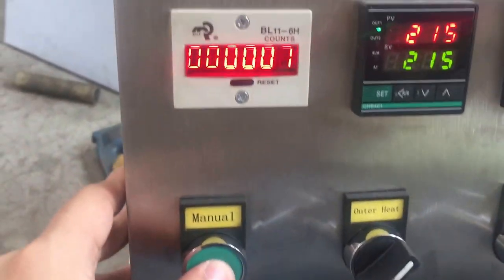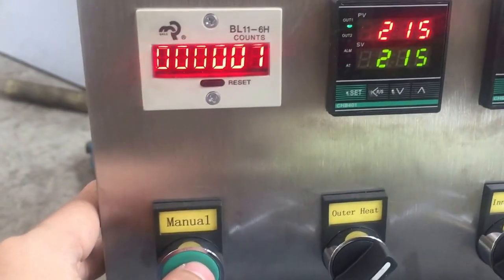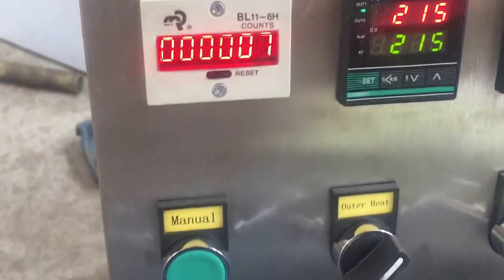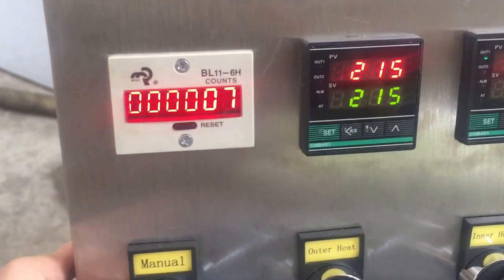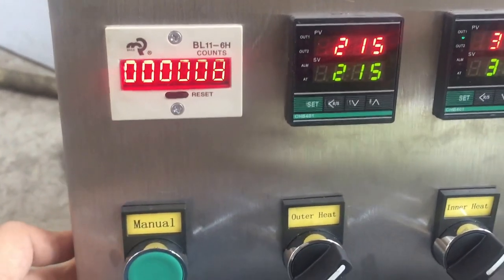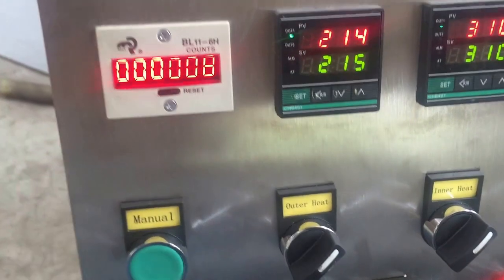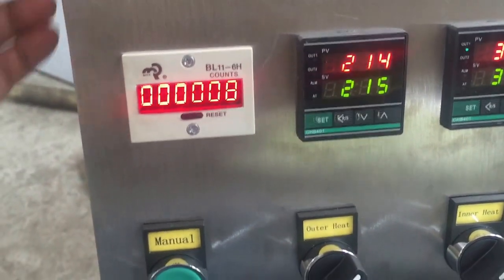So when you press one time, for example, you want 100 and you got 90, you adjust the volume back there, and then you use the scale to find out how much it fills, and you change it time by time.